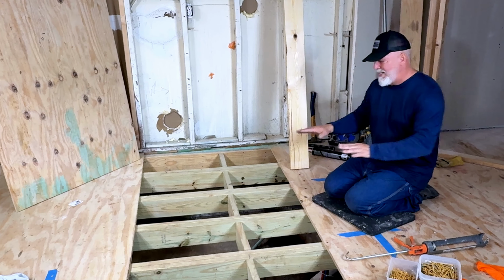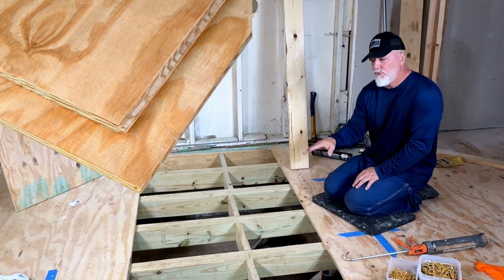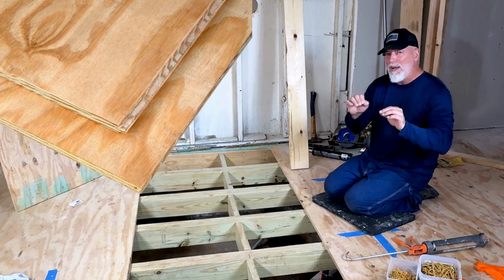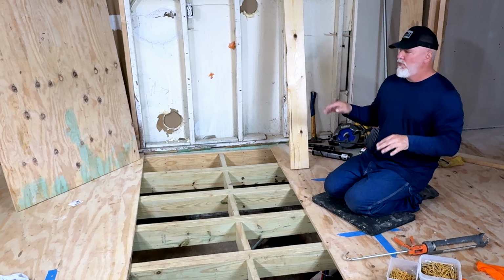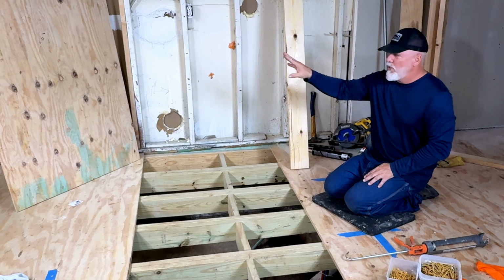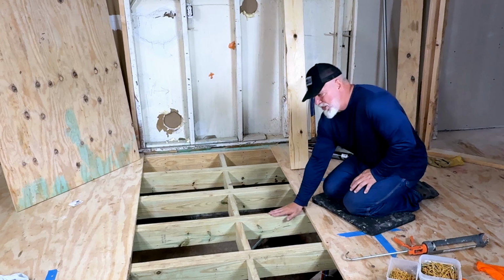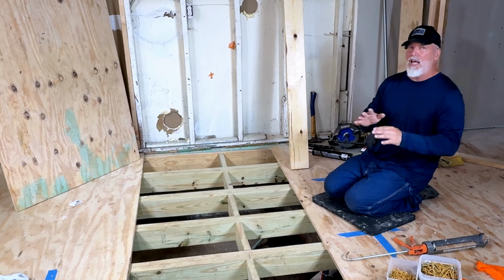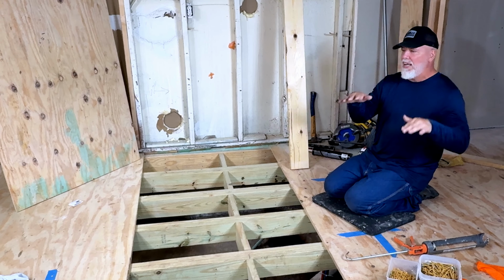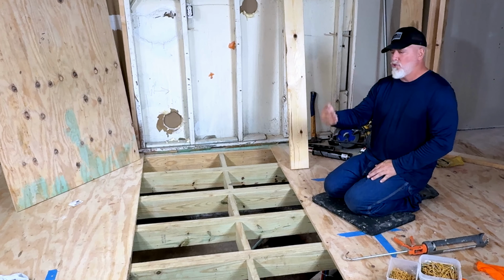This is the very last piece that goes on the floor. Now this is tongue and groove normally, like everything else in here on my first level. The very last piece though, the tongue and groove does not work. So I'm going to put just a regular sheet in. Now we are going to glue and screw that sheet down. My next sheet that goes on the top is regular plywood with no tongue and grooves, and they go directly over it in the same direction, screwed down.